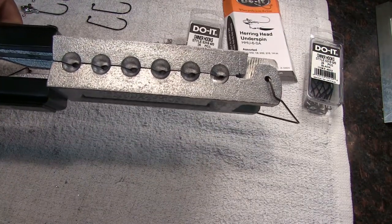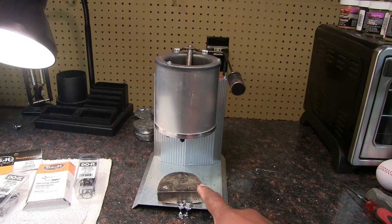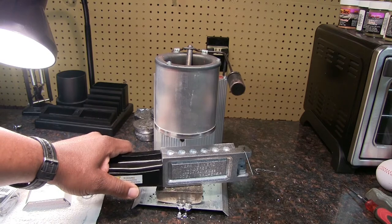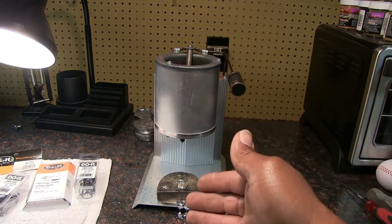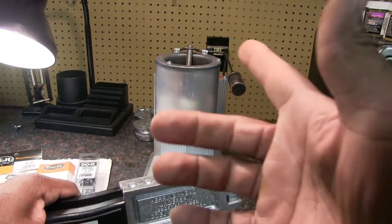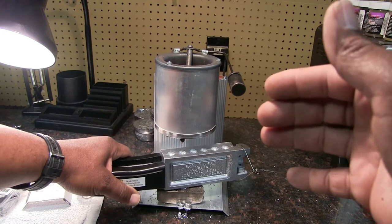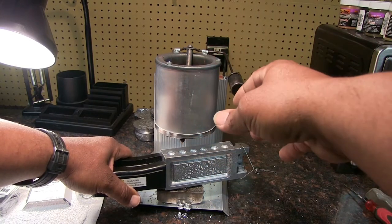We want to look at it and make sure it's got no big gaps in that line, then we go back over to the pot and pour the lead down in the top of this mold. Back over at the melting pot, on the bottom I have just a piece of metal I use to set my mold on so I have a nice base and I'm not holding it in the air trying to keep it straight under the spout. I like to check mine and make sure the lead is coming out nice and even in a nice stream, because if it doesn't, it won't pull all the way through the mold. We're going to place the mold up under the melting pot - this handle right here, you lift it up and it lets the lead come out the bottom.